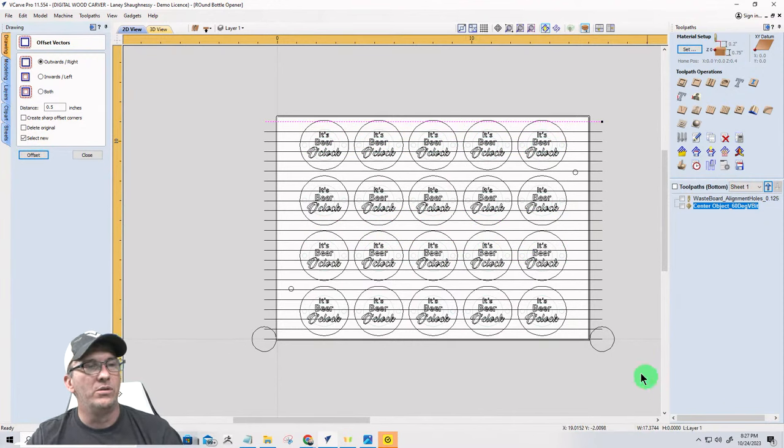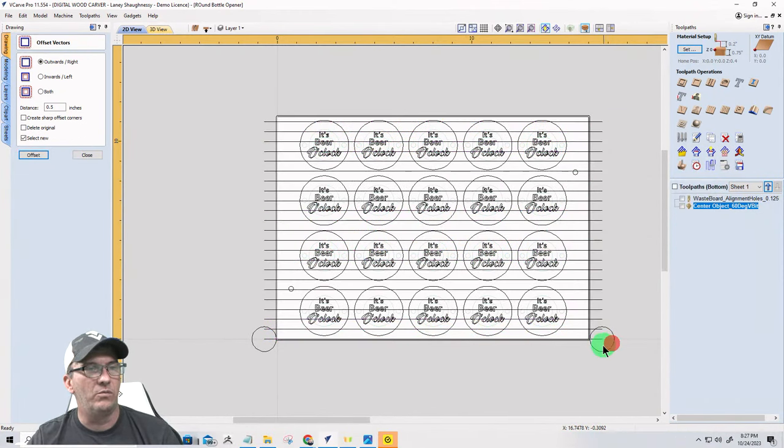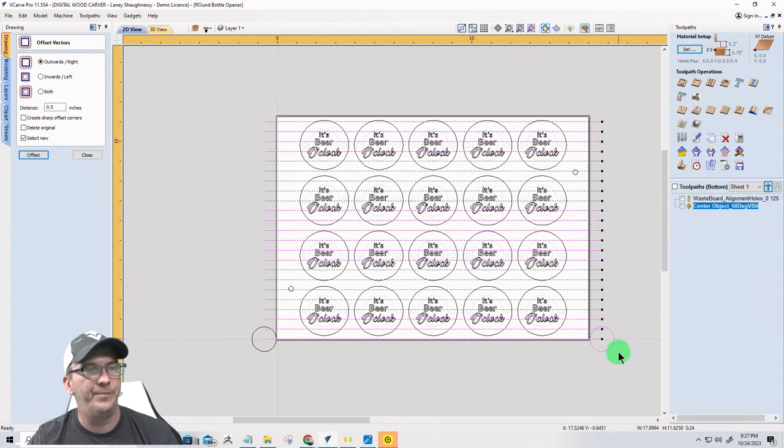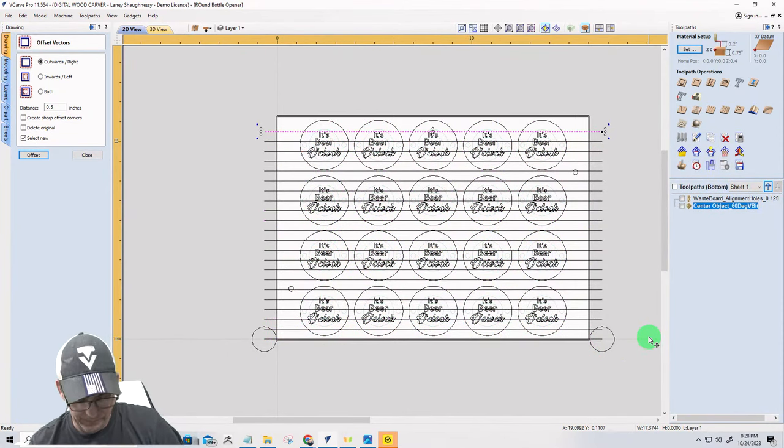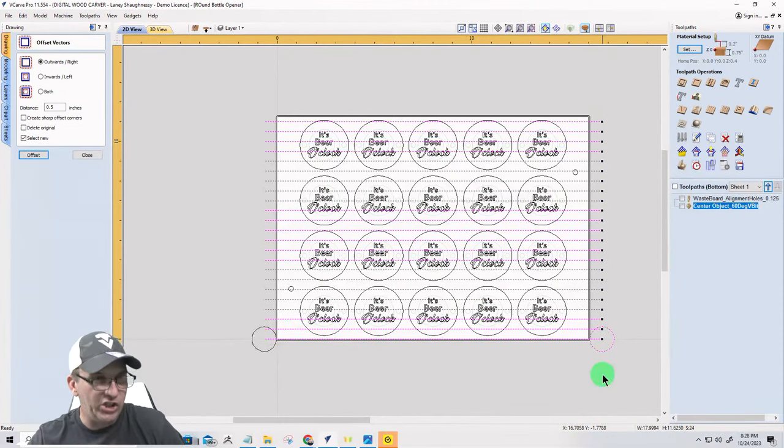And those toolpaths, I'm going to select those lines from right to left. I'm selecting in this order, right to left, straight up from bottom to top. Turn off that circle, don't need it. All right, stand by. When you're clicking on things, don't be dragging stuff around. Okay, one more time. Select the vectors. Hold the shift key. Turn that off so it's just those selected.